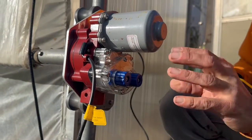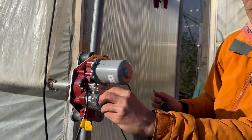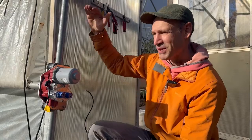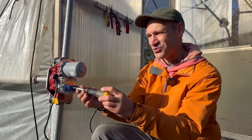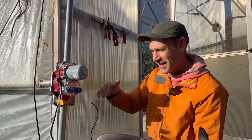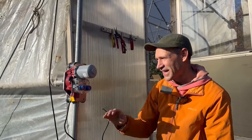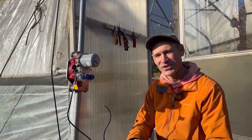It takes a bit of experimenting. I recommend starting your motor in the middle to give yourself time to find where that off-click happens. Once you've found that magic place where it's as high as you want it to go, off-click it and tighten the screw with a Phillips screwdriver. Then go inside your greenhouse, switch to manual mode, flip down the switch, and repeat the process to set the lower limit switch at the very lowest point you want the curtain to reach.